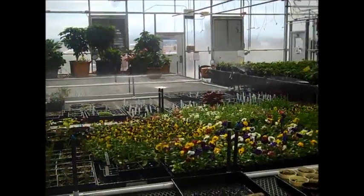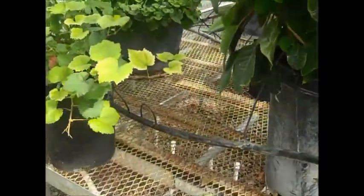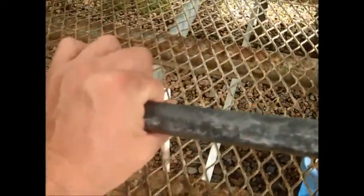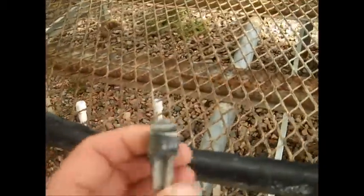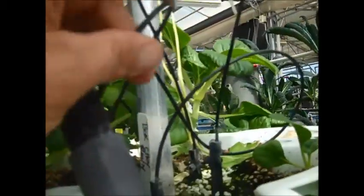You can see that spray running here — it's a drip system set up with three-quarter inch line. The three-quarter inch line is running a different type of sprayer. This sprayer runs off a quarter-inch line, as opposed to the eighth-inch micro tubing we saw before. These sit directly in the plant and deliver water precisely where it's needed, with three-quarter inch line running into the top.